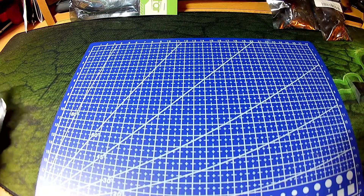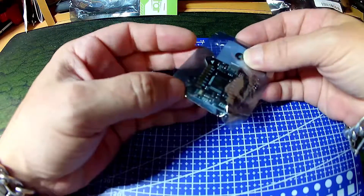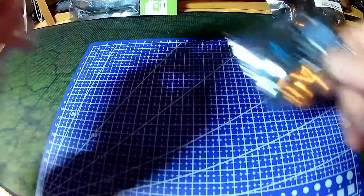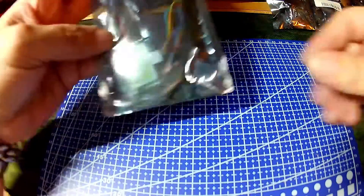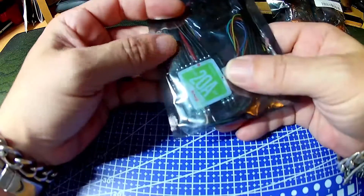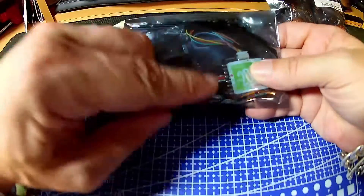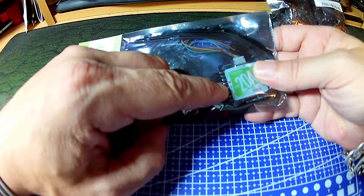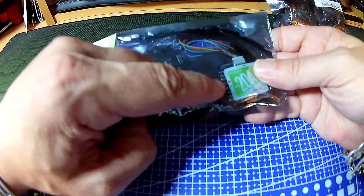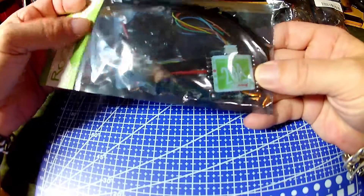I will be running it with a Lux flight controller. I'll have to do some vibration isolation because of the 6500 gyro on it. I'm stepping away from a conventional build with a power board in light of using a 4-in-1 20 amp ESC. I think all I need to do is run the VBAT for the Lux and my VTX off the input, which will do away with the whole power board.